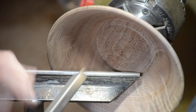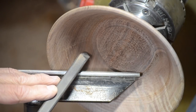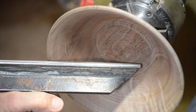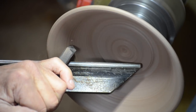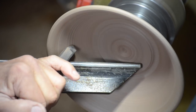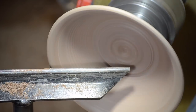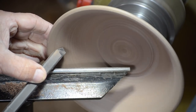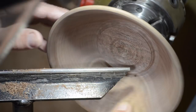I'll show you that. When I'm parallel to the side, I'm cutting with the bottom of the cutter. If I pull the handle out, I'm shear scraping. What I'm trying to do is just clean up those little tool marks or any area that wasn't blended properly. I need to move the tool rest out just a tiny bit for this area. I'm also dampening the vibrations with my fingers. There we go — that should leave me a good surface.